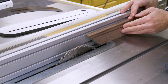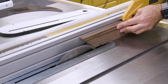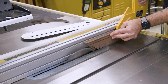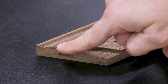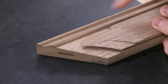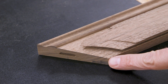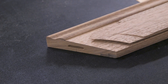So I'm pretty much set up for a fairly conservative cut — we can always take off more and change the angle if we need to. We are right up on that line, probably just a hair of material to remove, but we can scrape and sand that later anyway. The reason I kept pulling back was because I really don't want to do this cut until I'm ready for the final cut — every time I make this cut, I make my supporting material even smaller, so it gets a little nerve-wracking. Now we can continue with the entire cut.